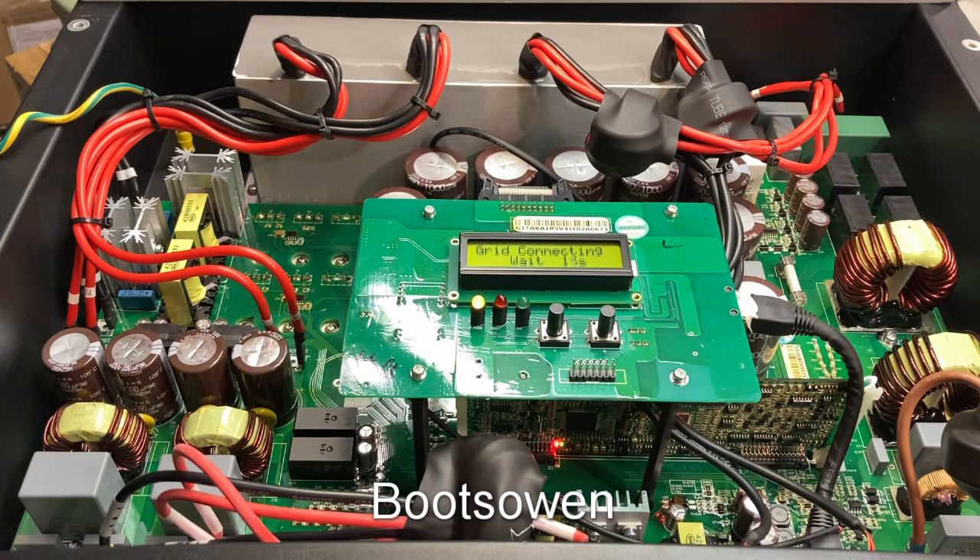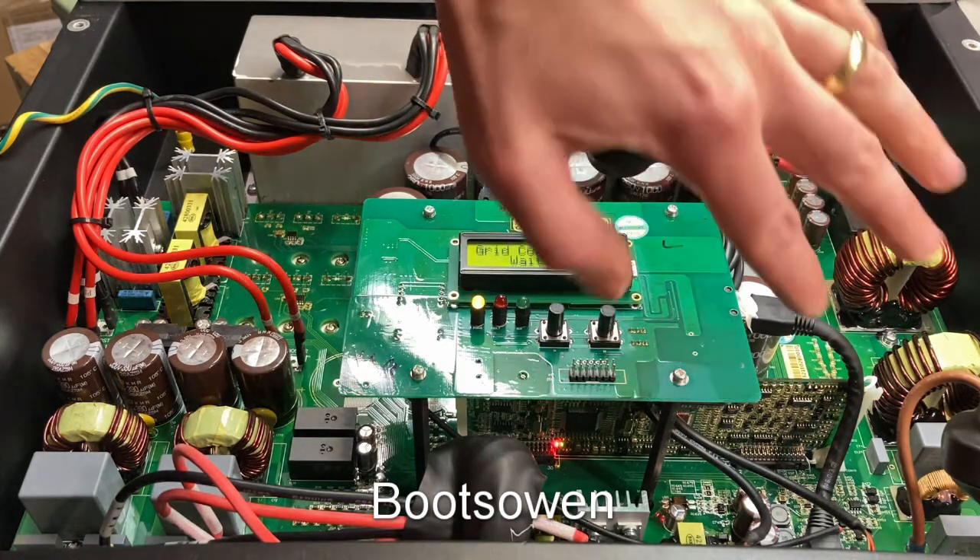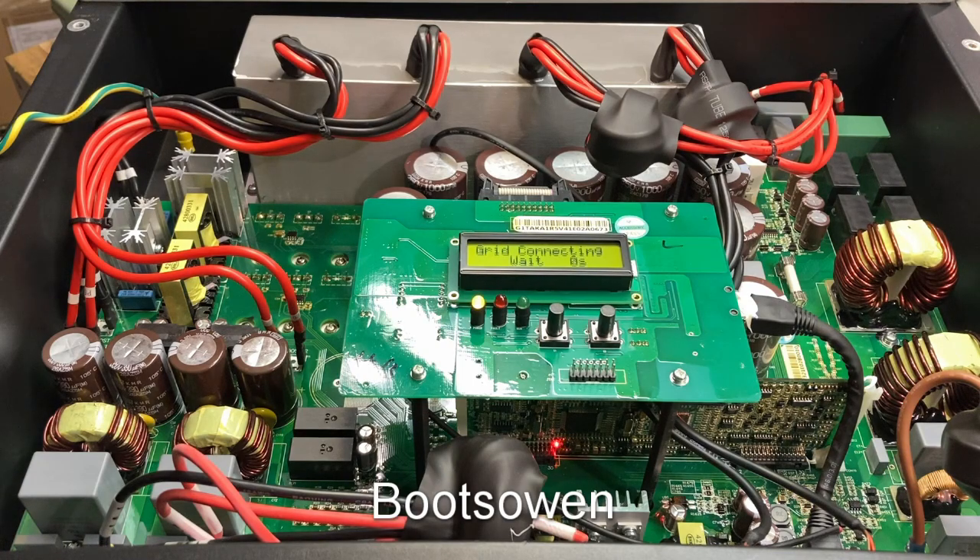So we're down to 16, 15 seconds and the little red and green lights are flashing. We should hear some relays opening and shutting presently. I found another two relays — there's one down here and another one; you can just see the gray of it over there. And there we go — it's zero. Click, click. That was interesting — same thing. Relay error, error code 29. Bit of a weird, almost guitar string sound for that last relay. So that's this board on its way out.